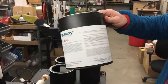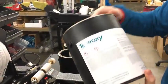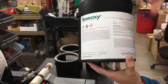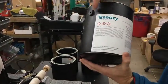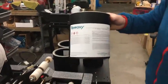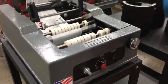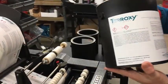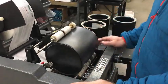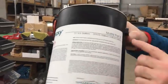You can see it's feeding a single label, and based on the registration, when it hits this ear we're able to control exactly where this label goes along the circumference of the one gallon container. We're simply aiming it between the two ears, and that's fully adjustable by adjusting this locking timer right here, so we can get it aimed anywhere along the circumference.